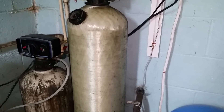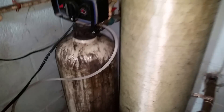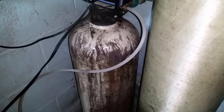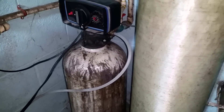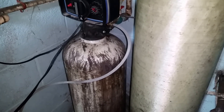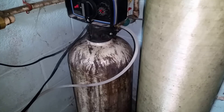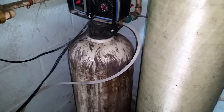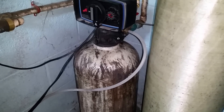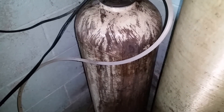I neutralize it with calcium carbonate and magnesium oxide, which raise my water hardness to extremely hard. It then goes into this system and pulls all of that stuff I put in right back out. So I've neutralized the water and then removed all of the stuff I used to neutralize it, along with anything else in my groundwater that would account for water hardness. Water hardness is only a measurement of calcium and magnesium in your water, so I could have a lot of other dissolved stuff that this system will not take out. Remember, this is a water softener — it's not a water purifier. I'm taking the magnesium and calcium out, and a few trace minerals, along with any cadmium that might be in there.